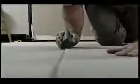As you're doing this, the bottom edge of the strip cutter is riding the bottom sheet edge, trace cutting the top sheet edge, ensuring a perfect butt seam.